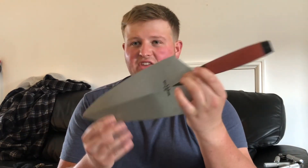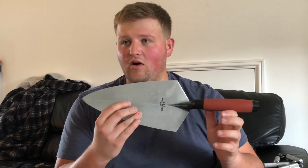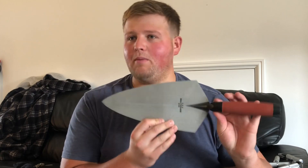Coming back to the trowel — one thing I always used to get was wrist strain from putting the V's in the mortar, the grooves. When you get taught at college you spread down, cut the back off, cut the front off, do the V's, and so on. With pick-and-dip style you're not doing any of that — you're just picking the mortar up and laying it. With traditional style using a bigger trowel, you're trying to get as much mortar scooped onto that trowel as possible for your long spread, whereas with pick and dip you're just tapping or slicing a section off and laying it.